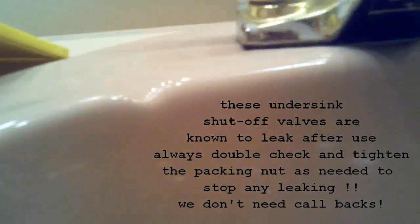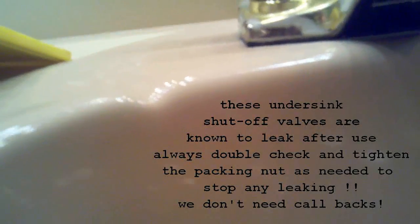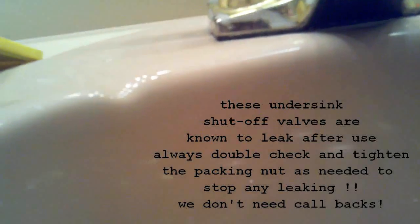Because I told you that there's a lot of debris after you use these shutoff valves and play with fixing the faucet. There's always a lot of debris in the pipes that's going to come, and you'll see it actually, because when I first turn this on right now, and I can feel my shutoff valves actually leaking. I'm going to have to tighten the packing up on that. You may see some black water come out initially.